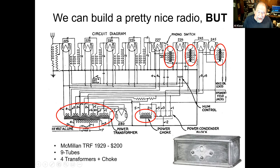And so you had four triodes being RF amplifiers, and another triode as a detector. Now to get sufficient amplification in the audio stages, you depend on transformers to take the 5x gain here, multiply it by 3 before you run into the next stage, and do that again with another transformer. And it's an AC set, so you have a big, ugly power transformer. You've also got a filter choke. So all of that adds up to money. And while it's a nice radio, it's an expensive radio.